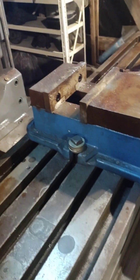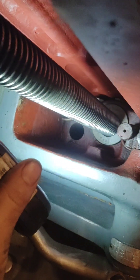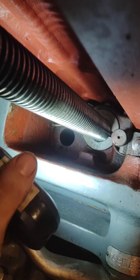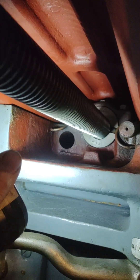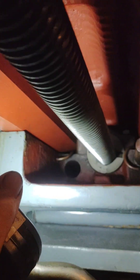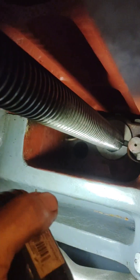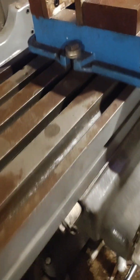I did some investigating and looks like the way this works — pretty typical. That's our lead screw nut and it's got two dogs on it, there to twist it in and out. I presume it's threaded into that pillow block to adjust backlash, but I'm looking up there and I see a third bolt which I suspect locks that in place.